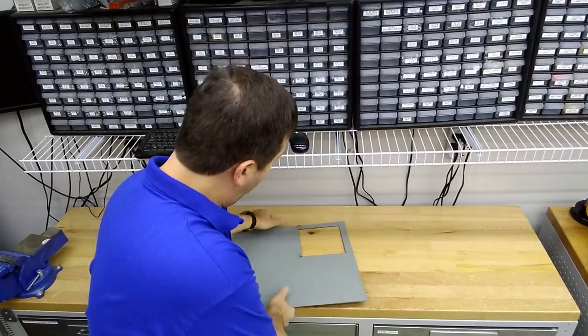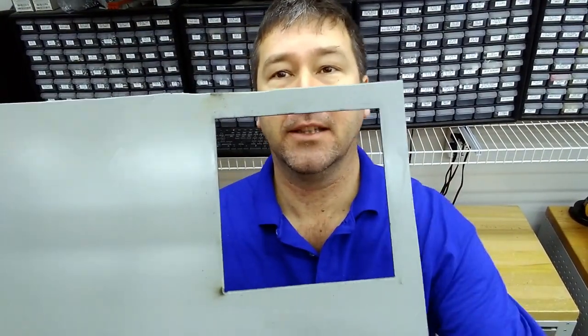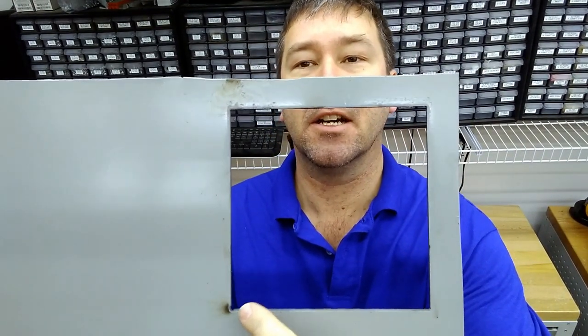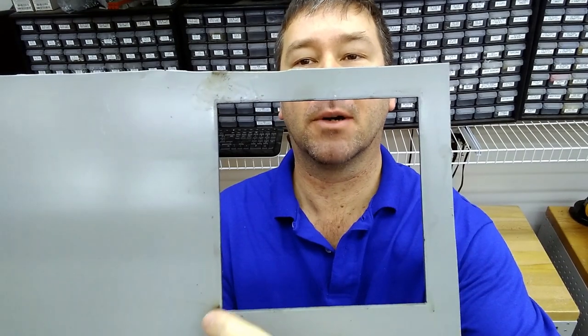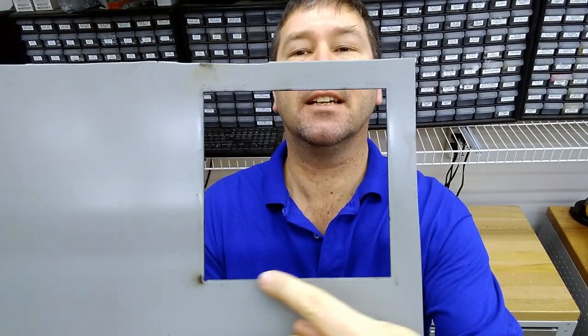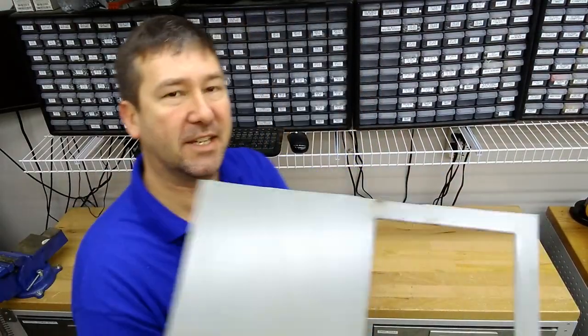All right, back at our shop, and I wanted to point out a few things before we go on to the jigsaw and the cutoff wheel. Mainly, this is fairly typical of what you would see on a plasma. You can see here where the pierce mark is. There'll be a little burning around it. Chances are I can wipe that off. I'm going to check in a second. And we have about a 1/16 of an inch discoloration around the hole, which is typically what you would see.